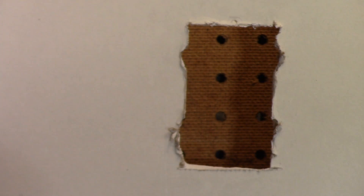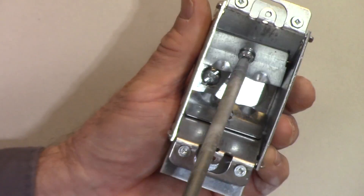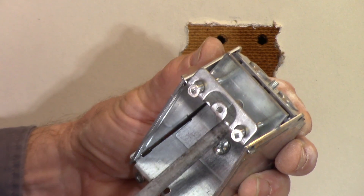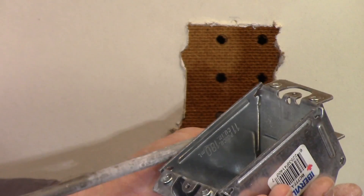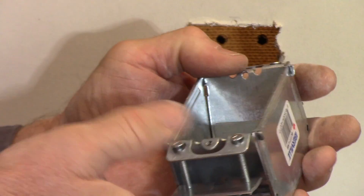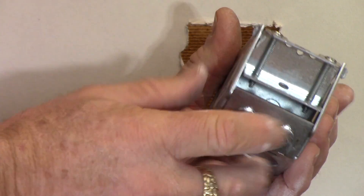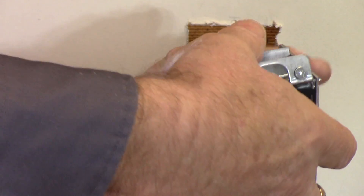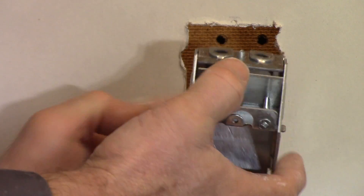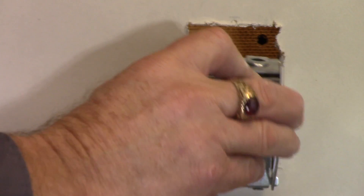With these boxes, before you install in the hole, you have to back out the clamp screws as far as you can — that gives you the most room. Back them out just until the screw is still grabbing, but don't back it out so far you lose it. Same on the other side. These four number six Robertson screws are backed out as far as they dare go for the installation. Then this box just goes in the hole — first you'd open your knockout and put your wire in, then work the box into the hole.